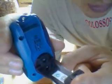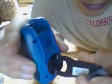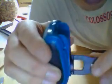Now I thought this handle is exactly in the center of the circle. We are lucky, because some models don't have the handle in the center, but a little bit off center, and this one is exactly in the center. So this could give us a very flexible coupling connection, which means that if it isn't perfectly aligned, it will still handle it, because it's flexible, because this pivots. I don't know how you call it in English.